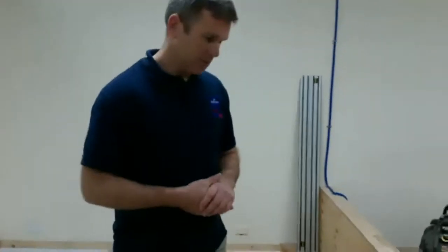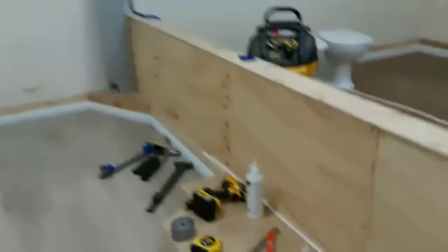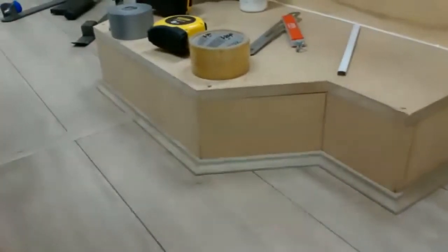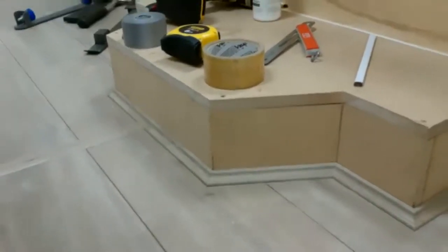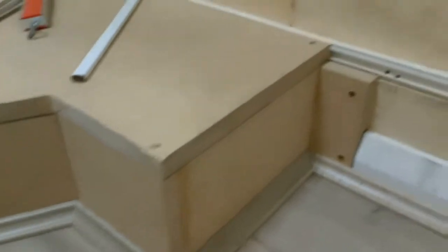Okay, so the next accessory I'm going to show you is the humble Scotia. Sometimes we have to use it, but for Quick Step, we have an exact color match in all our accessories. And you can see here, we've got an example of the Scotia. And this is the standard of what your miter joints should be, and that's what we spend a bit of time on in the academy, in the Master Installers course. And you'd be amazed at how many little tips and tricks you can pick up in that course.